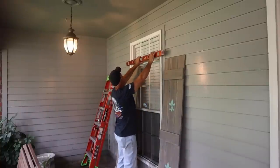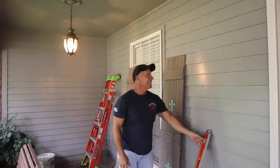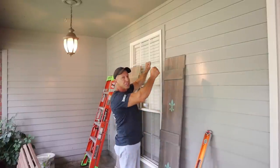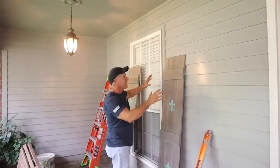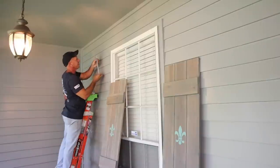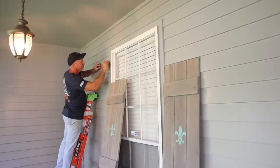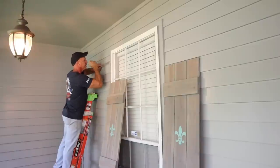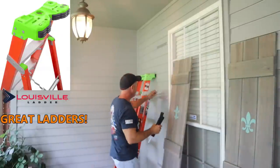You can check your siding to see if it's level. These are straight across, so super easy. I'm going to put my tabs — my cleats — right at the bottom of three of these, and when I push it on there, that's it. I'll do one side, bring it over to the bench, and match the other one exactly the same. I'll put the cleats down — remember these will face up — coming about an inch off the corner. I'll put one in the middle. I have my three pieces set in place, same as the back.